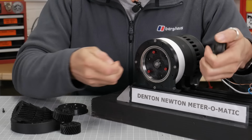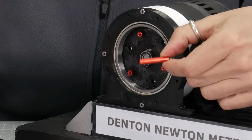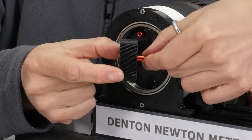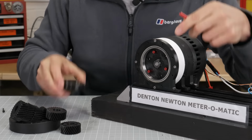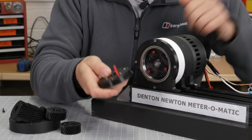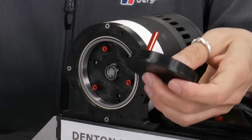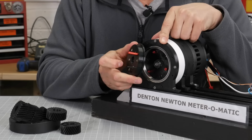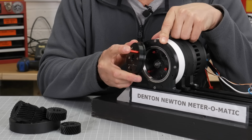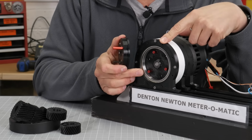So I've replaced the bolts with these red aluminium spacers. The spacers come through the second stage gearbox, through the bearings and through the gear, and they will pick up on the new faceplate like this. So they'll be pushing the faceplate round, and there's also 3 high tensile bolts that bolt down through. So now we have a much larger axle coming through to the faceplate with high tensile bolts. That should make that a lot stronger.